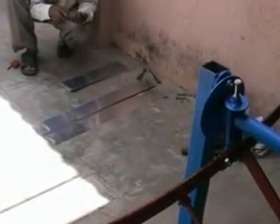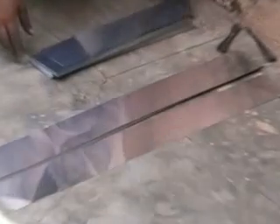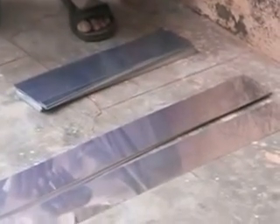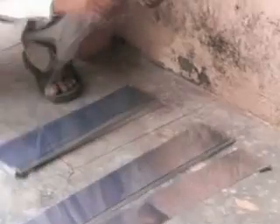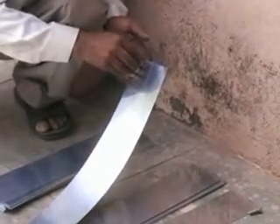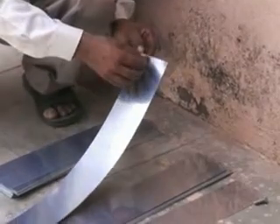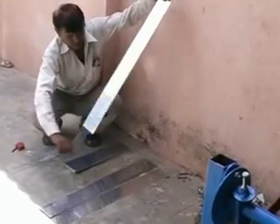Now we will look at the reflector sheets. There are two sizes of reflector sheet: one is 84 cm long, which we call the longer reflector, and another is 46 cm long. Before fitting, we will have to remove the protective coating on the sheet. This will give a very bright surface. We are removing the protective coating just by finger and we get a very bright surface beneath.